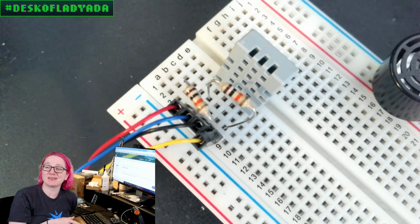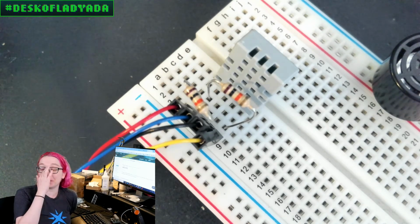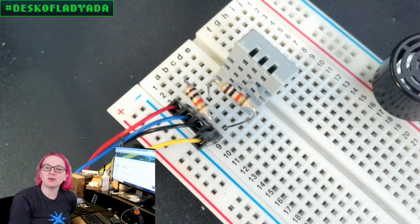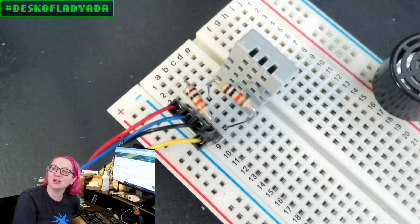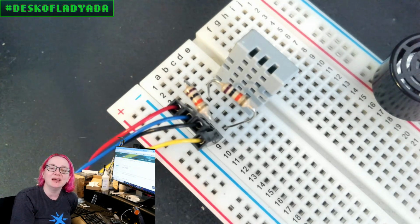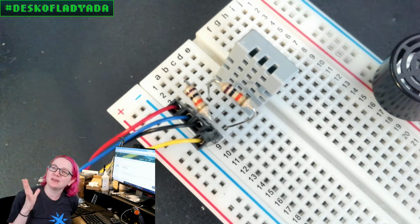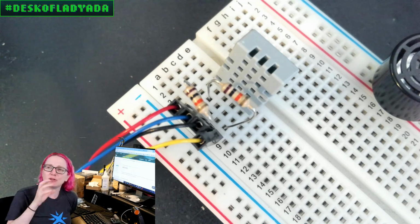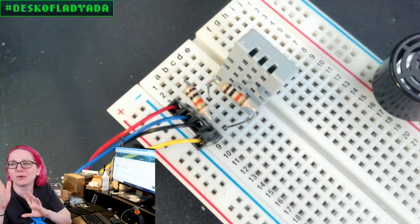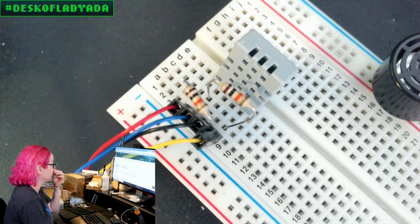The thing that's really annoying about the sensor is it requires a 20 kilohertz I2C clock, which is really low. Most things are 100 kilohertz. And when you set the clock for most chips, they expect you to go only higher than 100. You go up to 200 kilohertz, 400 kilohertz, or even 1 megahertz for I2C clock. It's not very common for microcontrollers to set their clock rate to below 100. So, for example, as I was doing this, I just wanted to read the sensor. Before you know it, it turns out the Arduino core doesn't do the prescaler right, so you can't use the low clock rate. And then I was like, okay, I'll do the PR for that. And then 2 hours passed, but I did get this sensor going.